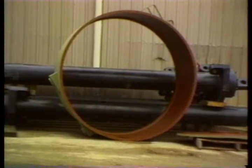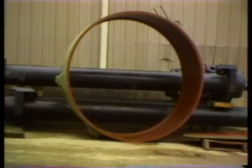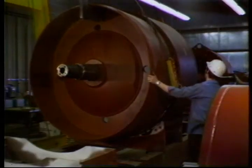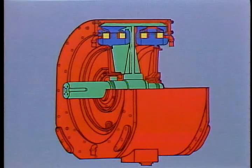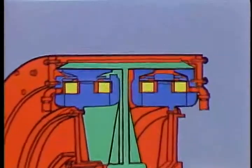The brake goes back together just about like it came apart. We're going to reassemble a model 7838 — the large one. This is a brand new brake, but the procedure is the same. Since you'll probably never get a chance to see the inside of the magnet, we'll start with the assembly of it. Each of these assemblies actually has two coils, and each coil is wound with a Dacron glass silicone-insulated magnet wire.